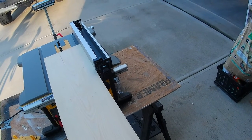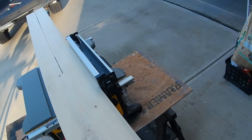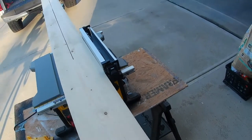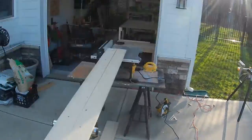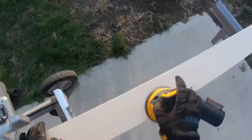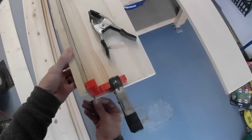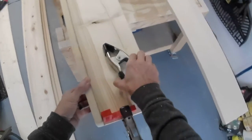This is a 16-foot 1x10 that I've already cut to length for the tray ceiling, and I'm going to split it right down the middle — that's going to act as the left and right sides of the full beam. I'm going to do a little bit of light sanding on all the boards just to take some of the sharp edges off, but not really smooth it down because I want the boards to look a little rough — I want character in them. Now I'm going to attach the sides to the bottom 1x8 using 90-degree guides and a couple of clamps, taking my time to make sure both ends line up perfectly. Then I'll tack them down using 16-gauge brad nails.